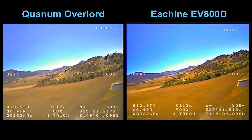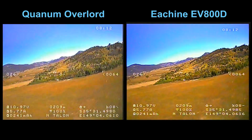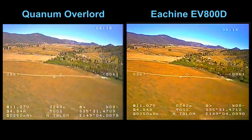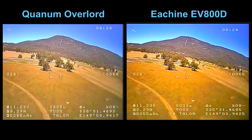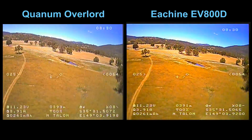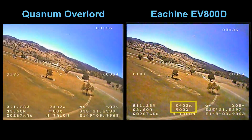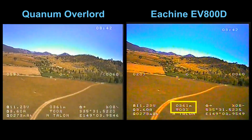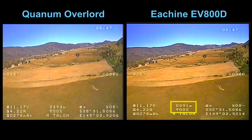So at this stage I'm seeing very few glitches on the headset video. Usually they're associated with flying down to the south end of the strip where there's a few trees that I go behind, so I'm not really concerned about that. I'll do one more wide sweep out to about 400m and still don't see any change to the RSSI indication — it's either 100% or 0% — so I decide I might as well just head out and keep an eye on it.